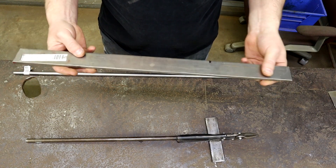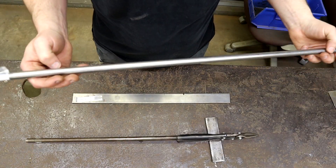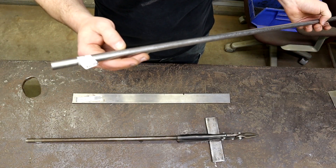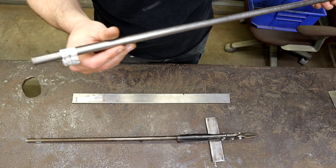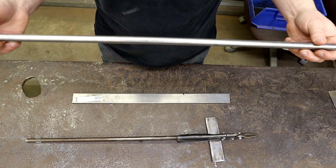You need this so you can clamp your shear into your vise on the table. Also you're going to need some half inch mild steel tubing. It comes in three foot lengths at your big box stores in the metal bin section. You can use this for the handle to add leverage to your shears.